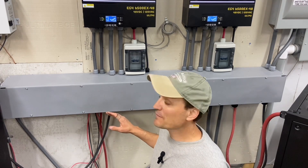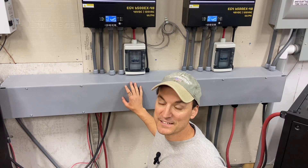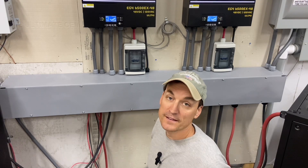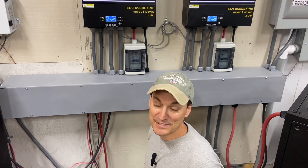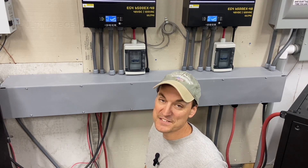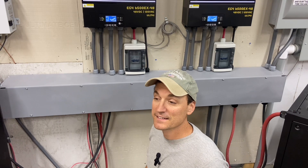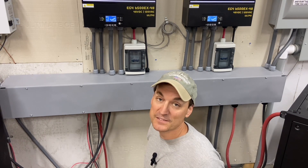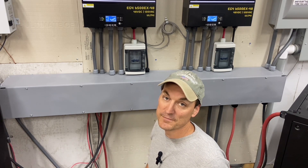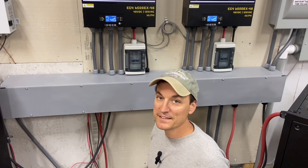I've got a couple of key words of advice here. So if you're going to be doing one of these projects, consider getting a hole punch to punch all these holes. These step-down bits do work as long as you're willing to wear long sleeves, gloves, glasses, and ear protection. It's really noisy and it shoots shavings all over you — it's not fun. But this is actually the second one of these I've done, and they do work, they're cheaper. So it's up to you guys. If you're willing to spend a little extra money, it's a whole lot easier and cleaner to get a hole punch — you won't have to vacuum up all the shavings.